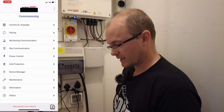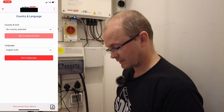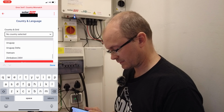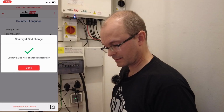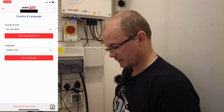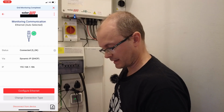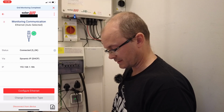So now we go to country and language. We go through the menu. So we go to United Kingdom. Let's see where that is. United Kingdom, 230 volts. There we go. So we set that, and that's done. It's saying country mismatch. No, that's fine. So now we go up, go to monitoring communications. That's okay. That's dynamic DHCP, which is just what I want. So nothing to do there.